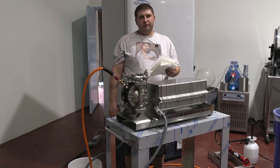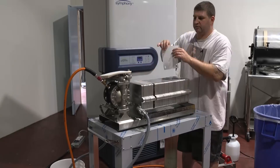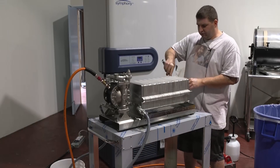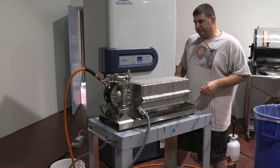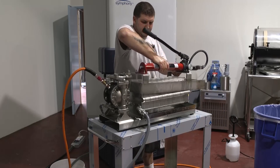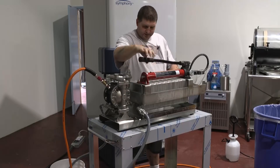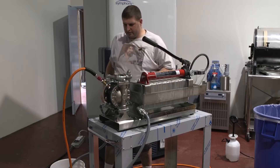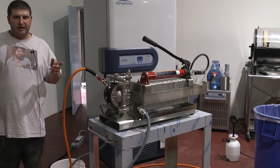Now we're going to do another really interesting pull — this is using silica as filtration. It's going to bed out. So we're going to start by putting in a stage two paper. Now we're going to do a multi-step process with a media that's going to be used to pull out further contamination. When you winterize, you can winterize better, or you can also do this in the winterizing procedure. We're going to bring our pressure back to 4,000 PSI and make sure we're all in place. We're going to use a method with silica that is going to help cake up the paper and pull more contamination out.